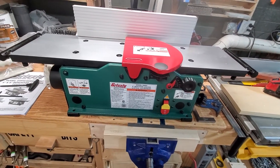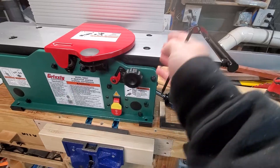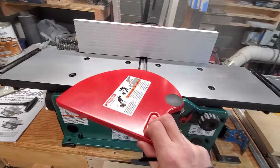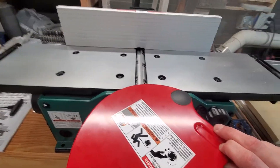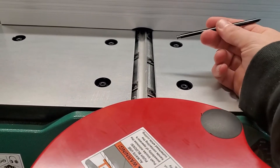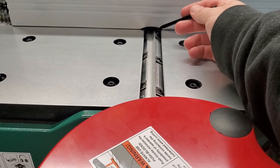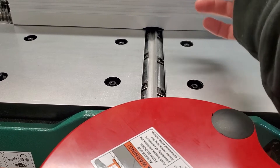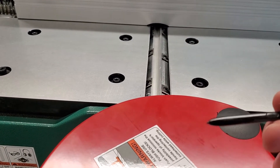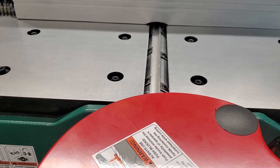What I like about this is it's actually really simple — you have the lock over here, the adjustment knob to set the infeed table up and down, and the guard. With the spiral-type cutter head, some people might get confused — it still has the same type blades, it's just not the entire row, and nor is it helical. These are straight blades. I believe these are direct replacements for the spiral cutter head, and I think the reason they do this is to accommodate not having too much noise.